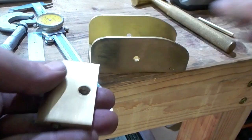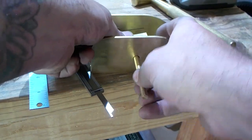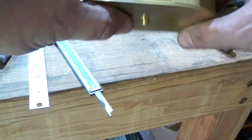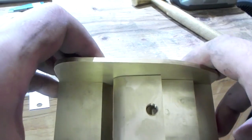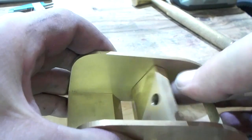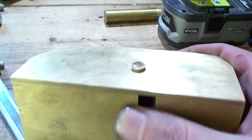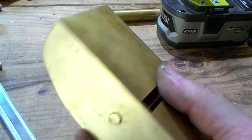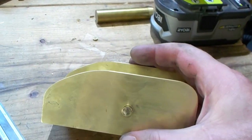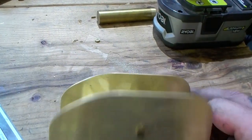Go ahead and take your cap - you want your pins to stick out maybe a little better than an eighth. Our quarter-inch pin is peened. I wasn't able to get it all the way down - that quarter inch is tough - so I'm just going to accept it and we'll have two little circles; at least they'll be even. Go ahead and mill this to about a thousandth off the side and then bring it to the belt sander to clean it up.